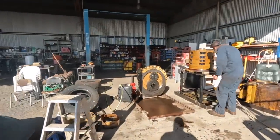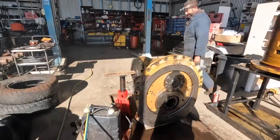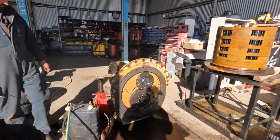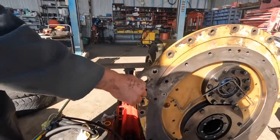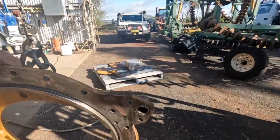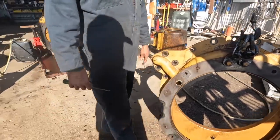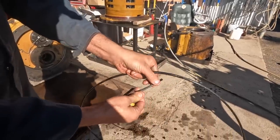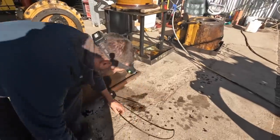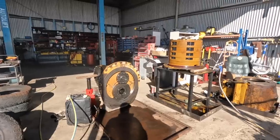Another morning - the fog's just lifted, so it's turning out to be a nice sunny day. The transmission is out. I'm just about to go spraying again, so we'll get a quick update. She's all in pieces and it's actually not as big as you sort of think, but still pretty beefy. We've got Ozzy here - he's the one that's been overseeing whipping this all out. I think we've found the leak - mostly leaking from the lube pressure O-rings on the diff, adapter housing going to the transmission. That one there was very hard and flat and like concrete, as were every other black O-ring on it. So it's a good time to update the seals - not very flexible anymore, they've lost their ability to seal. Very flat and hard. This transmission mightn't have been out for 10,000 hours, so that's not too bad considering.